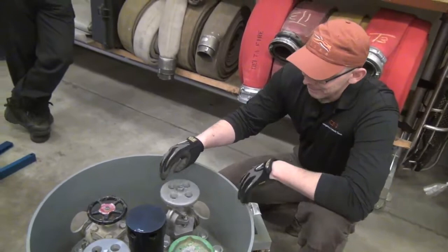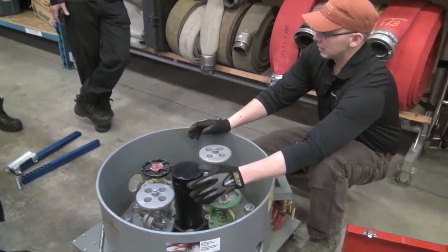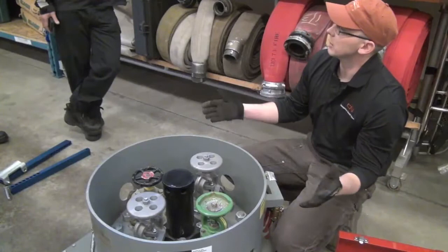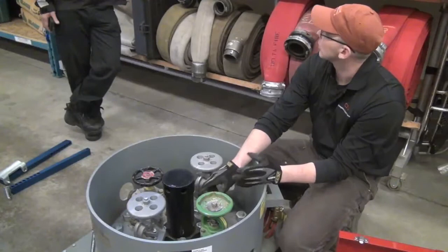The safety valve is on the car to protect it from coming apart. It shouldn't ever activate if everything's right. On a chlorine car on a hot summer day you might get 125-130 PSI inside the car; the safety valve is set to open at 375 PSI - a really big safety margin. Short of the car sitting in a pool fire and cooking, we don't expect that to go off. But if you've done everything else and are still looking for the leak, there is potential for mechanical failure where it could be leaking where it seals to the base of the car.